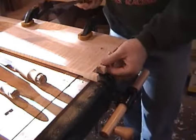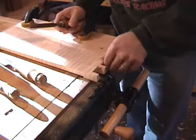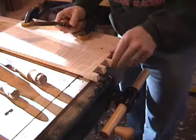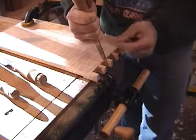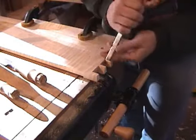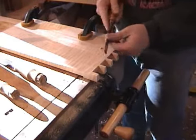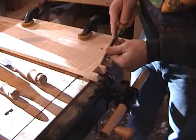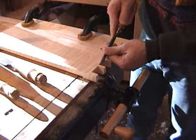This maple is tough stuff. Mahogany, walnut, cherry even isn't this bad. If you get stuck with the grain as you're coming down from the top, you can wiggle the chisel a little bit. You can come in at a skew angle, come in like this and then skew it back. You'll have to try different angles to find the one that works best for you, but eventually you'll be able to work this stuff free.